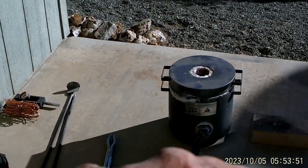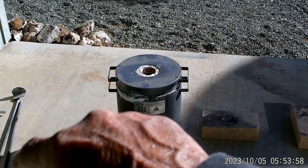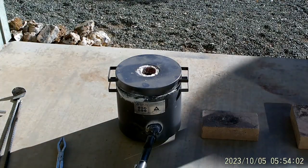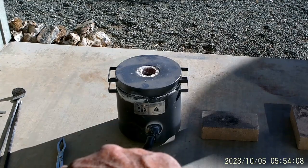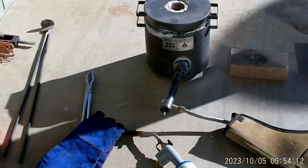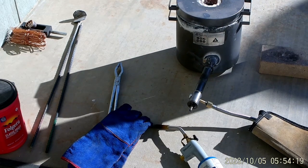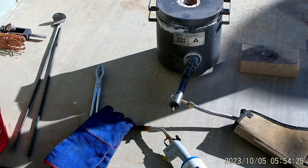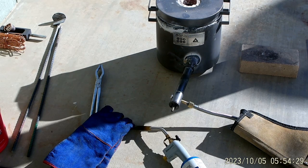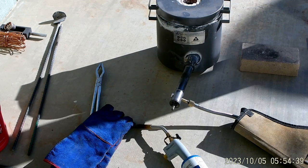The little scoopy tool is to pull the dross off the top after we pour borax in and stir. This silver tool that looks like a long pair of pliers is what I use to grab the crucible and put it on the fire brick. I've got welding gloves, a welding apron, and leather boots. I'm going to use this propane bottle to start the foundry.